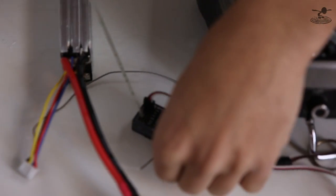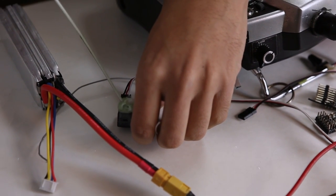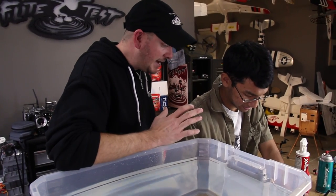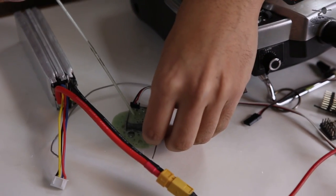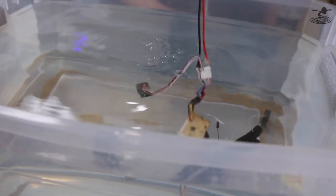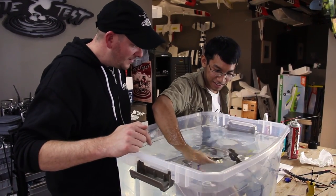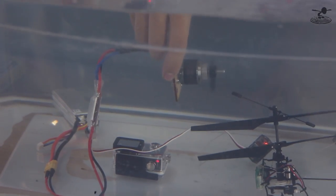So you don't decase it or anything? It's better to decase, but if I'm just going to be real quick — basically just make a huge mess. This doesn't attack any of the electronics, it doesn't short out or anything. It has no conductive properties — well, it still has some but it's very, very minimal. For most electronics it's perfectly safe. Now we should be able to throw this in the tank. It's not going into failsafe. Signals are still coming through just fine.